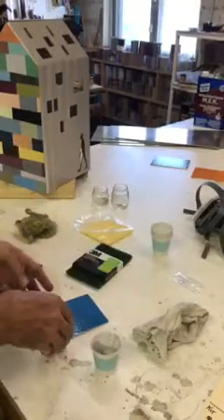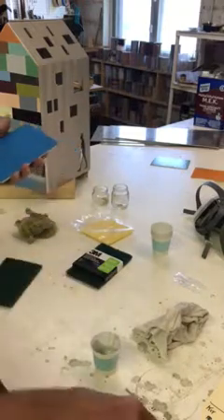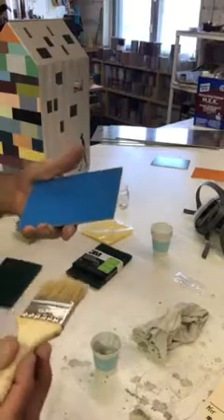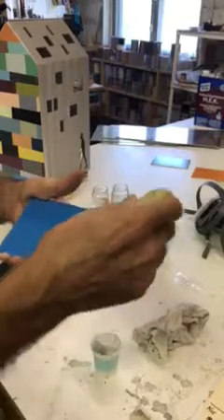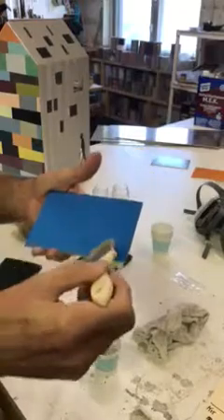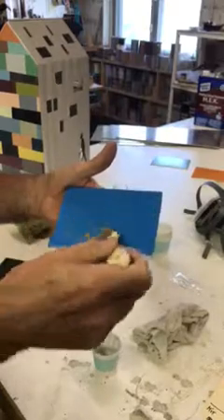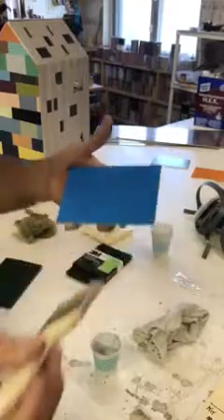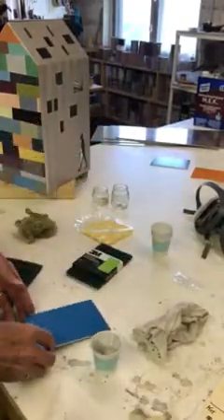As far as the paint, it's a 3 to 1 ratio — mix the supplied paint. When you're painting, use the same technique we used with the primer: start in one area but keep brushing into the area you've been painting to feather that paint into the existing paint. Use different approaches from different angles to feather it. You can let that dry and apply a second coat if necessary the next day.